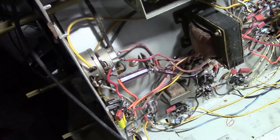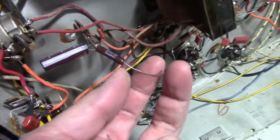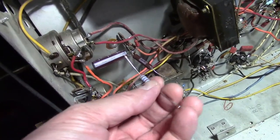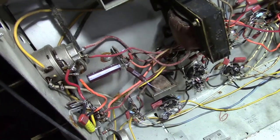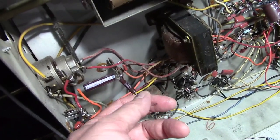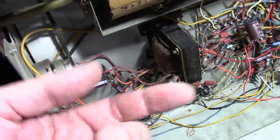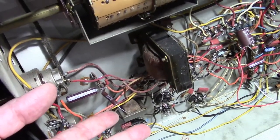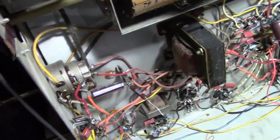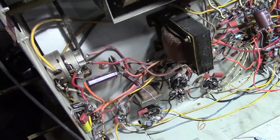Well, that was a fun little exercise in futility because I just found the real problem. This very nice-looking 3k 5-watt resistor is open. I got to wondering about that because when I put the 2.7k in parallel with it, this guy was getting pretty toasty and that one was cold. I don't know if this burned out at some point during the project, maybe because something else was amiss, or was it bad before I put it in? I'm not in the habit of checking brand-new name-brand parts, but perhaps this was bad right from the get-go. That explains everything.